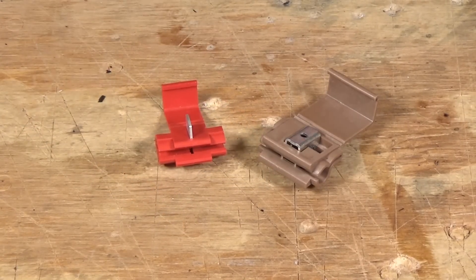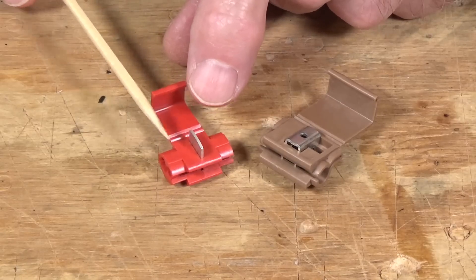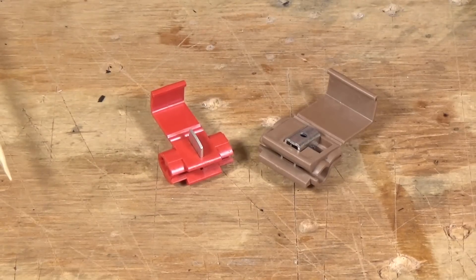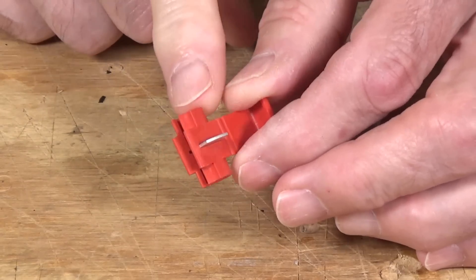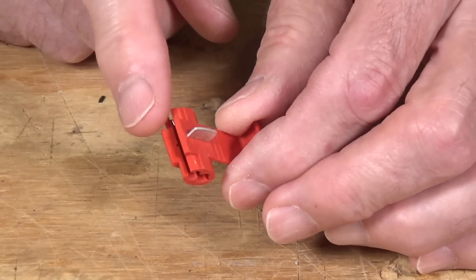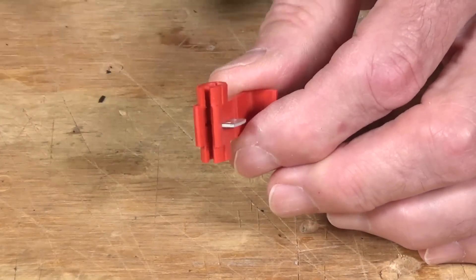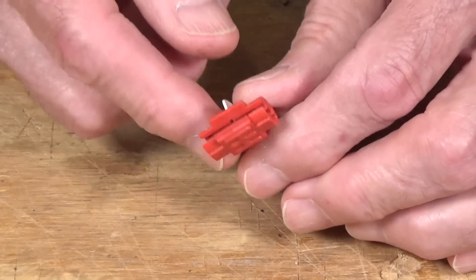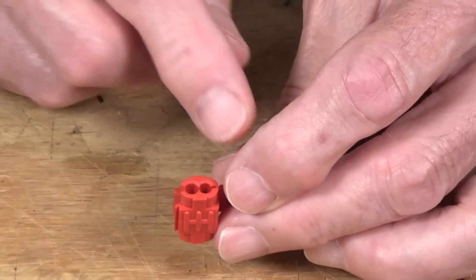The second type, and the one I use for a lot of my wiring as you've seen in past videos, are made by 3M. These are Scotchlok insulation displacement connectors — IDC for short — but more commonly referred to as suitcase connectors, because when you close the little lid it looks like you're closing a suitcase. These were designed for low voltage wiring, heavily for automotive uses, and there are other types for telephone and telecommunications splices. They're very useful for model railroading — we're talking about things under about 34 volts DC.